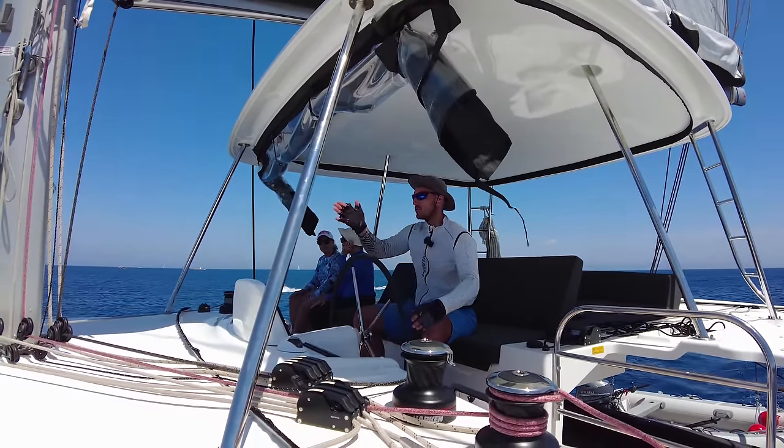Now for the mainsail, we have to go upwind. And you always check if there are any people in front of the boat, sleeping here, because we're going to turn up to the 20 knots of wind and go upwind with engines, which means the apparent wind speed will increase to 24, because we're going to produce wind going up with engines. And people just might get wet. Of course, check the windows. And then, of course, prepare the spaghetti.